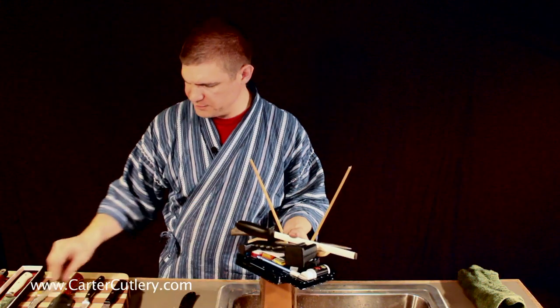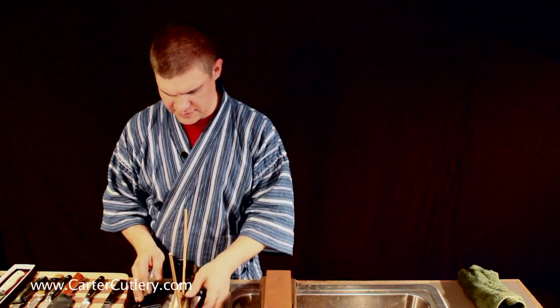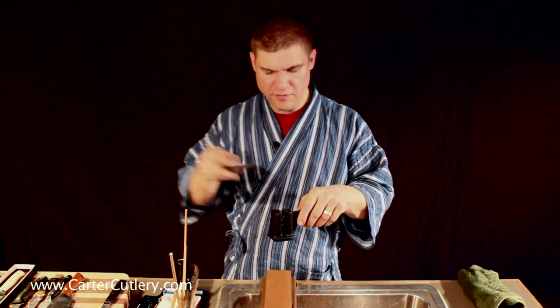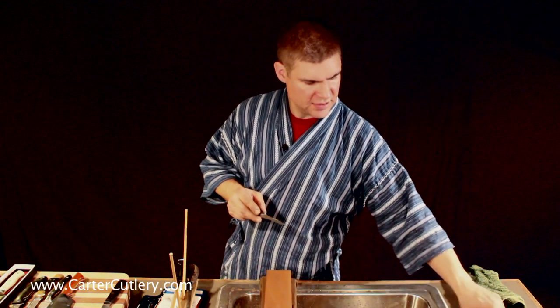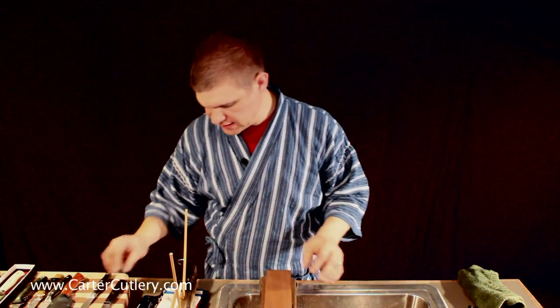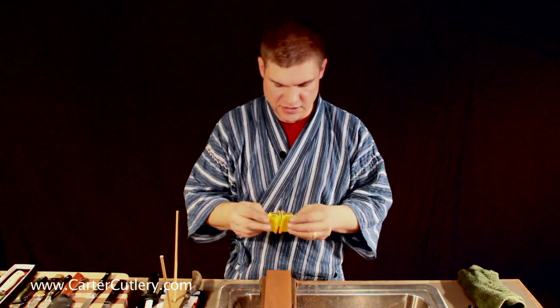Here is a plethora of things that you may see in the marketplace for sharpening. You might see some kind of a little device like this, designed for just pulling the edge through. This kind of a sharpening system doesn't take into account at all that you need to grind the secondary edges. It only addresses the primary edge. Here's another little gadget that essentially is the same.